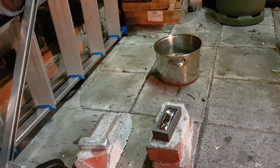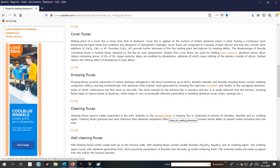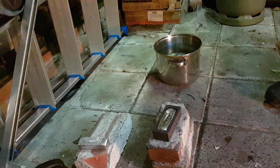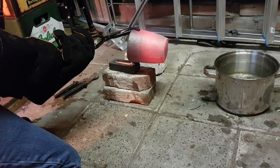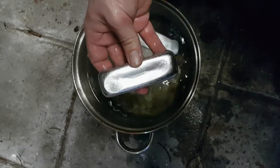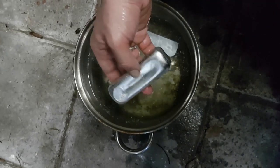What I want to do involves the next fluxes. As a basic I want to use the cover flux, as you can see here on this site. It says the melting point of a cover flux is lower than that of aluminum. Cover flux is applied on the surface of molten aluminum where it melts, forming a continuous layer protecting the liquid metal from oxidation and absorption of atmospheric hydrogen. So what it does is: when it melts, it forms a layer on top of the molten aluminum so it won't get any oxidation in it.